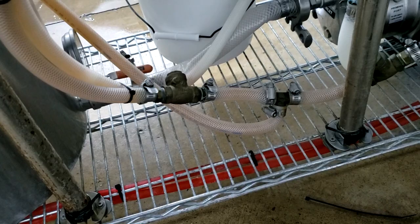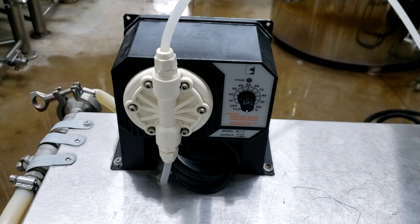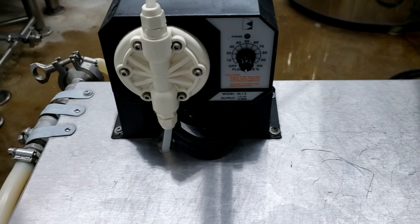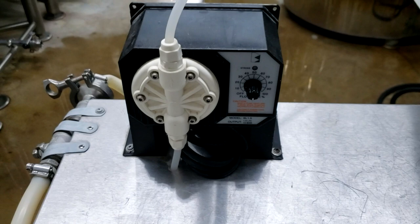For the pump I hooked up a foot pedal switch so I can just stand there and push the foot pedal whenever I need the caustic. I've got valves on my hot and cold water lines as well. This is what I used for my acid dosing pump — it works out pretty good. I was looking online trying to figure out how to inject the peracetic acid in to sanitize the kegs and found this pump. You can dial it in to make it a little faster or stronger. What I did is pre-mix my peracetic acid down so it's not so concentrated, then run the pump full blast and mix it with cold water. It works quite well.